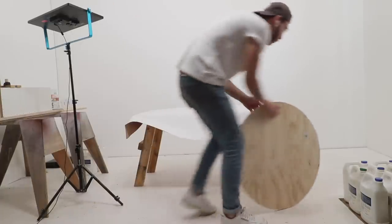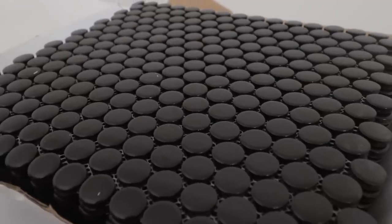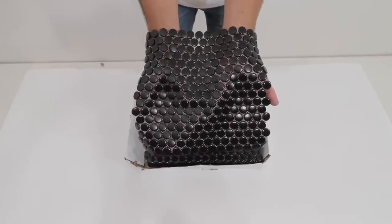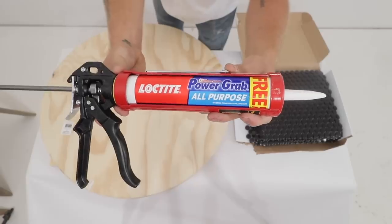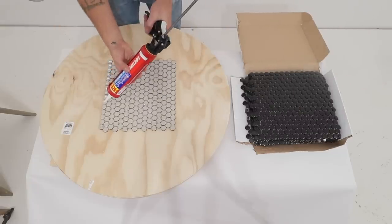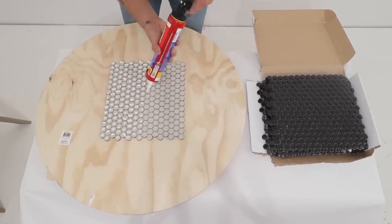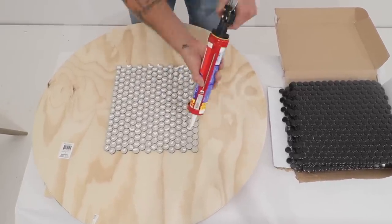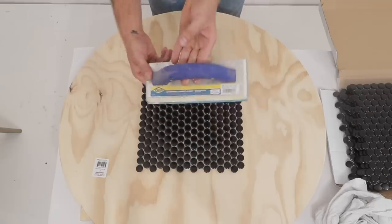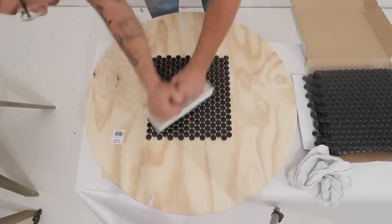Not a perfect circle, but it rolls well. I picked up these flat black penny tiles off of Amazon and they were a pretty decent deal — I'll leave a link down in the description. They have a good matte finish and pick up a little bit of light without being too glossy. I've been using this Loctite Power Grab construction adhesive quite a bit lately and I really like it. It tacks quickly, which is what I'm looking for when installing this tile. I started by adding a dab of adhesive to each tile, making sure I didn't get too much squeeze out so that it would show through the grout lines, and then I did my best to line up the center tile with that mark from the screw we used earlier. I found that using a grout float was a great way of applying even pressure and getting these tiles stuck to the plywood really well.